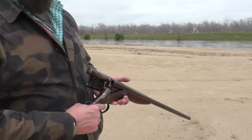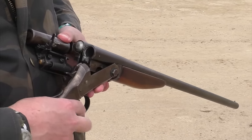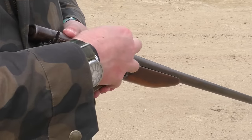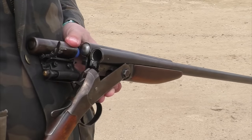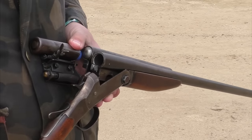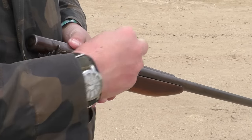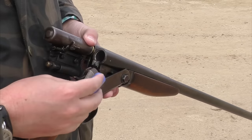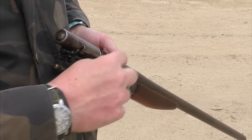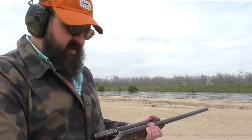Let's load this thing up, which is a process unto itself. The number one most important thing is getting in a position with only two arms. Go ahead and get that carrier out of the way so you can throw one in the magazine, and then when the carrier comes back, it feeds into the carrier. That little plate on the left is to hold that round from flying out into oblivion. We'll put our second round in, and let's put one in the chamber, because you need one in the chamber to really get this started. We'll seal that up and have to cock it as we get ready to fire.